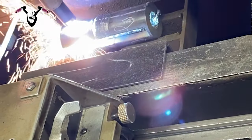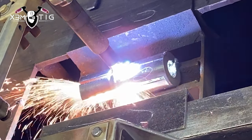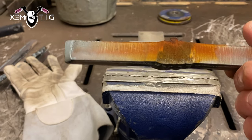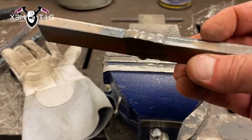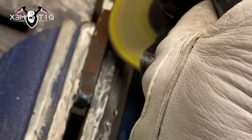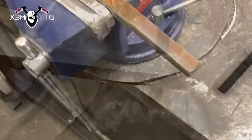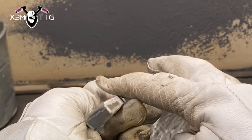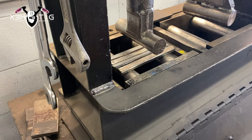That's it for the weld part. Now we're gonna cut it — all that hard work is gonna be cut with an oxy-acetylene torch into four pieces that we're gonna grind: two root and two face. Grind the root sides, cap, around the edges. Don't chase too deep — even if you see some spots of porosity, that's mostly from the cutting torch they use to cut the pieces. Even if you got something there, don't go too deep, don't chase it. Round the edges and now we're gonna go for bend test — two root and two face bends.